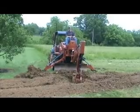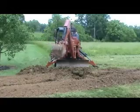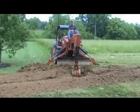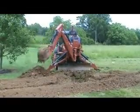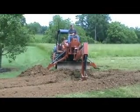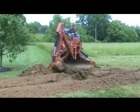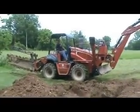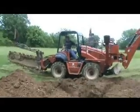Trenchers can work up and down hills as long as it's not so steep that what you excavate will be eroded away by water, rain, and so on. They are very top-heavy machines and should never be operated across a hill. Trenches cut into slanted ground are more likely to collapse as gravity pulls straight down on the unsupported dirt.